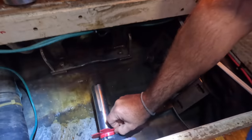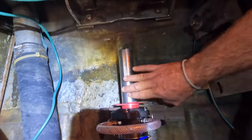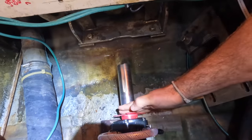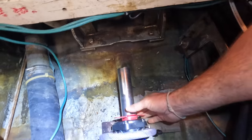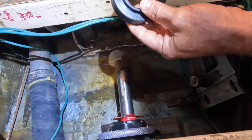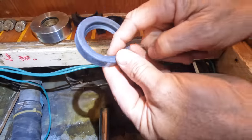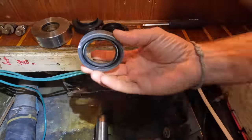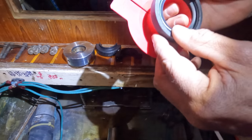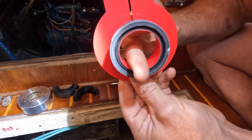The first unit I installed has the carrier sitting loose against the lip seal. This slides down under the lip seal, so if there was an imperfection in the shaft — which there isn't, I've cleaned it up — you slide this under and it allows the shaft to slide without the lip seal touching the shaft. I'm going to pull apart the carrier: the lip seal is here, with the part number forward and the spring side inside, so I just install this gently. You can see now that this is going to slide on the shaft, not the lip seal.